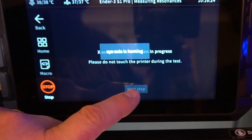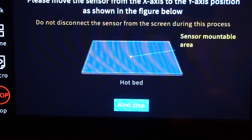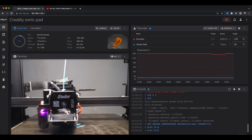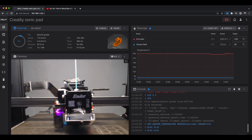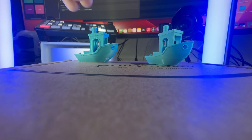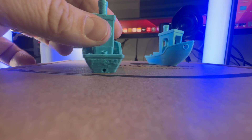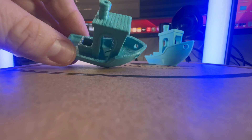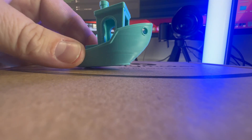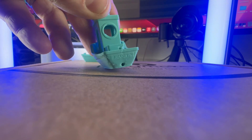For the aim of testing, I printed a PETG Benchy. I then popped the G unit onto the printer and allowed the input shaping on both the X and then the Y to be saved and then rebooted. The first print took around about an hour and 34 minutes, while the second took a mere 55 minutes. You can see the noticeable differences between the two. The changes Creality have made simply measure the X and Y in two separate measurements, which are then added to the bottom part of the printer.cfg file. The print on the left is the first one before input shaping took place — there are some deviations, very easy to see, and a tiny amount of stringing. This is PETG, so dialing these settings in is going to be pretty apparent.